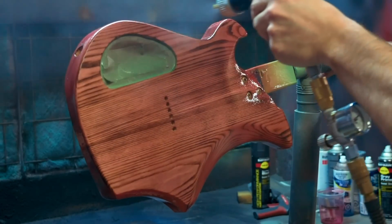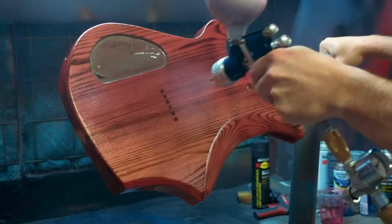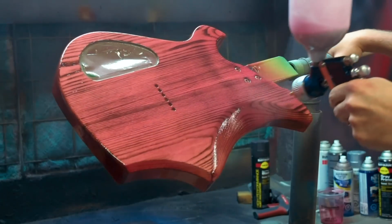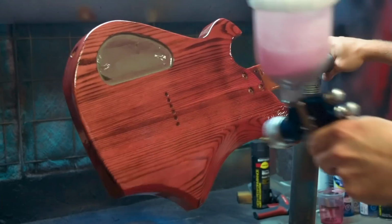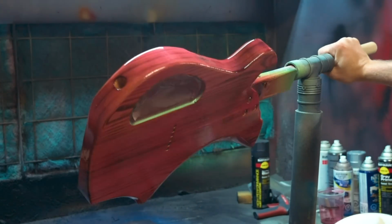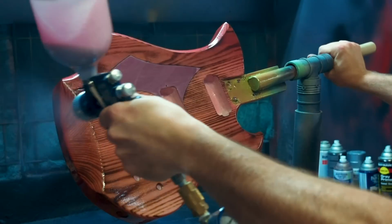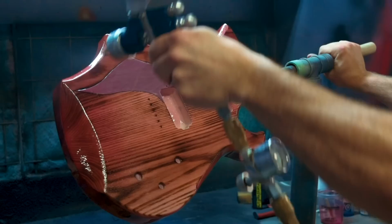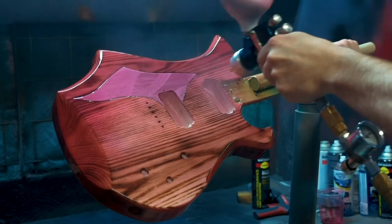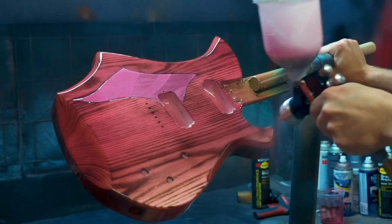I'm using my larger gun for this to get it nice and even for the first one. This is my DeVilbiss FLG 400. It's what I use for all my urethanes. I use a Warwick for my lacquers when I do lacquer jobs. This guy's available in the description as well. It's a nice versatile gun. It doesn't have as wide a fan pattern as some of the SATA and Iwata guns, which is fine because I'm spraying a guitar. But it flows out the paint nicely, and this unit comes with 3 different nozzle sizes. So it's got one for clear, one for color, and one for primer if you want to do it that way. Whatever works for you. It comes with a 1.1, 1.3, and 1.5.